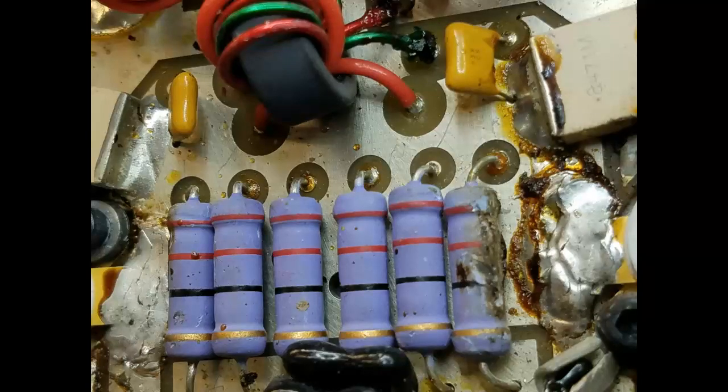This is the actual circuit board in that ALS-1300. When they had replaced a field effect transistor, if you look at the source tab of the FET to the right of that bank of resistors, you can see the edge of the resistor is all gouged up. There's a lot of extra flux and it looks like they didn't have enough heat on the transistor tabs when soldering — none of the solder really flowed. You have to look through these things for bad soldering and defects whether they've been serviced or came straight off the assembly line.